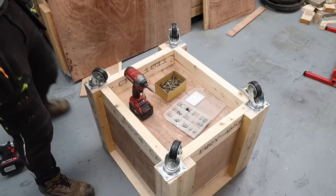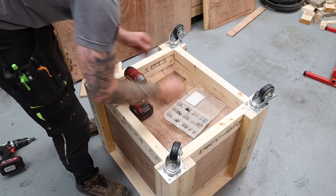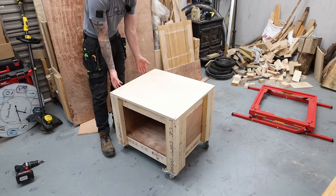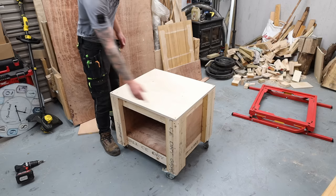Just screwing the casters on — brake ones to the front, nice and simple. There's plenty of stuff to screw to underneath here with this four-by-two frame; you don't have to add any blocks. Just moving them out to the corners and screwing them home, using a couple of washers because the holes on the casters are a little bit on the large side. Now I'm just going to add a border — raise it up so there's a lip all the way around just to hold the table saw. I'll be screwing the table saw to this anyway, but a nice border also protects the edge of the plywood and protects my legs from banging off it. So we're going to cut a four-by-two to go all the way around and frame it off, then hit it with a round-over bit.